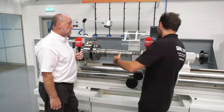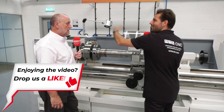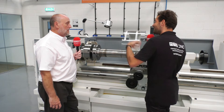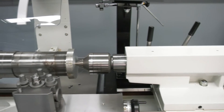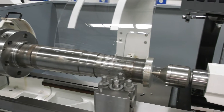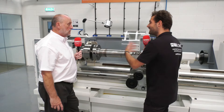And what about operator ergonomics? Because sometimes you might be machining down here but the DRO is over there and you can't see it. So how do you deal with making it easy to make those big parts? On all our long bed machines, the DRO travels with the apron, so it's there where you need it. And you've also got spindle speed controls over here. What other features are on this machine to make it easy to make what are quite difficult parts to make normally?